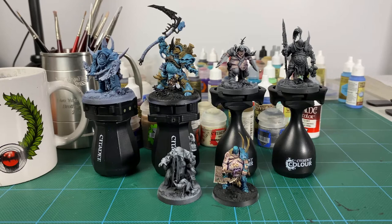That UV light is going to start curing it, and no one's ever talked about that. You've got to be super fast — you can't have it open to exposed light for more than half a minute. It might just be an old batch of resin they sent me, I don't know, but the first time around when it failed there was an entire film — almost a layer of solidified resin — already in there when it started. Anyway, I started it again and the second time I got the ring out, but it had tons of problems — gaps, where it lifted off the tank, peeled away, and stepping lines. Outside of those bad areas the detail was really, really crisp, like what people say is true, but with so many defects the result just wasn't usable.